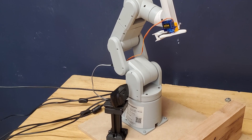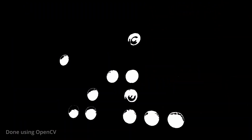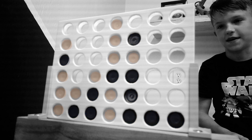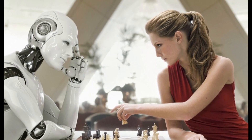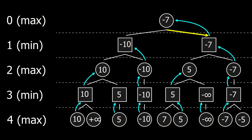There's a camera mounted next to the robot that we're using to detect the state of the board. The camera knows roughly the color of each player's token and will filter the image to pull out the areas that are those colors. Once it knows what areas of the image are the robot's colors and the player's colors, it can filter out where the individual chips are and store that inside the computer.